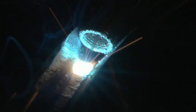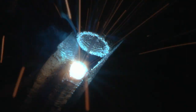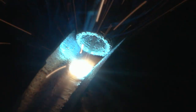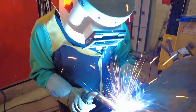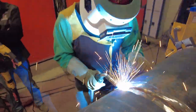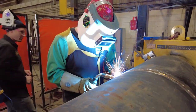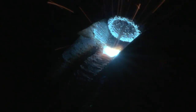Generally, he can always change the welding current with a remote for any variables he comes across — different fit-up, land, even a slight spot of land on there, or any hi-lo that could be present on the pipe. He can just change his variables, move side-to-side more, or pause — those kinds of things.